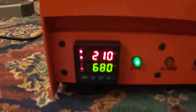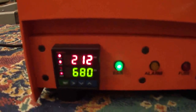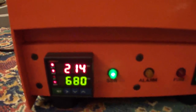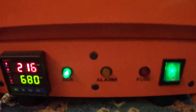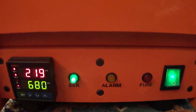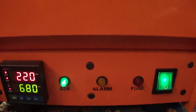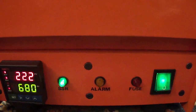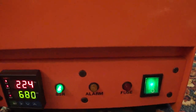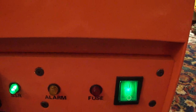That's a PID controller. The green light is the SSR — solid-state relay — which comes in and out every time the element goes off and relights. The orange light next to it is the alarm: once it reaches the preset temperature of 680 degrees, that light should illuminate and the buzzer should sound. It goes off after eight seconds — this is just to tell you that your metal is ready for pouring. The red light next to it is the fuse, that only comes on should the element blow.